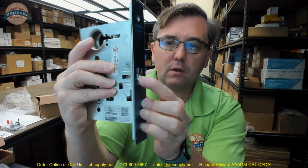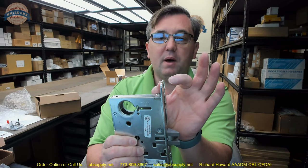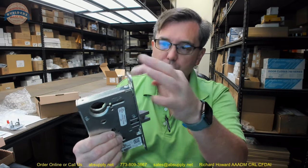We have got that all sorted out. The armor front is a term used for a plate added to the edge of the mortise lock. In old-style mortise locks from 100 years ago — the 1920s, let's say — you would have seen a mortise lock with a very large, thick piece of metal. Through that metal would project the latch bolt and any stop works. This is a passage, so there are no buttons or stop works, and it does not feature screws to hold the cylinder.